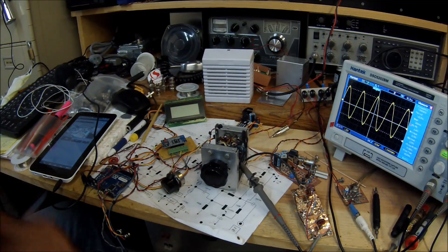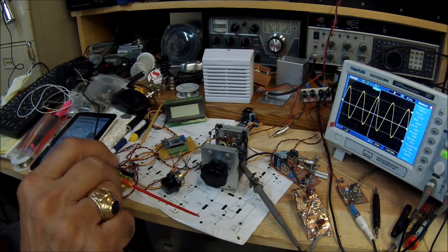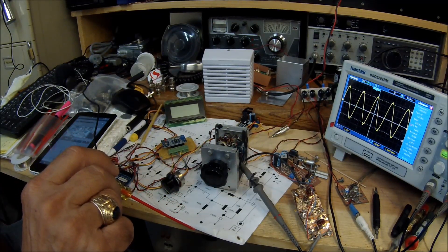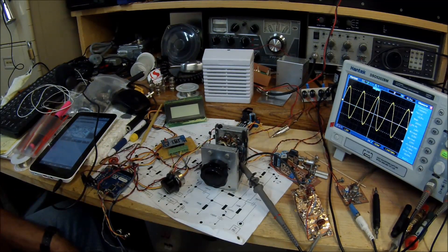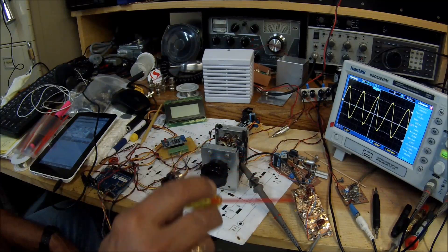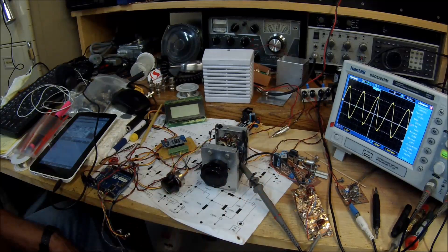Again, this is N6QW, and this is a joint project with KK6FUT called "Let's Build Something." I created just a short video the other day and had it uploaded on YouTube — only to share it with a few people aware of this project so they could see the results. I never got so much feedback in all my life about shaky videos. So let me tell you: close your eyes. What we want you to do is listen to the radio, and it's amazing the performance you're getting with just a couple of components — an audio amplifier, a double balanced mixer, a local oscillator, and a little RF amplifier stage.